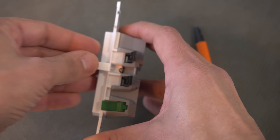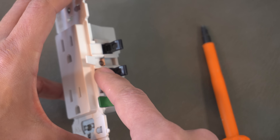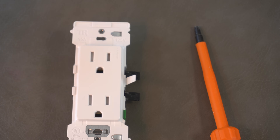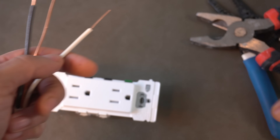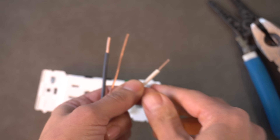Here's a quick tip: behind this white door is a copper tab. Be sure to pull it out with pliers to create two separate circuits, like when your outlet is wired to a switch. And to prep your wires, on the back of your receptacle you'll find your strip gauge so you can cut your wires to the proper length. Now let's get on to the wiring.